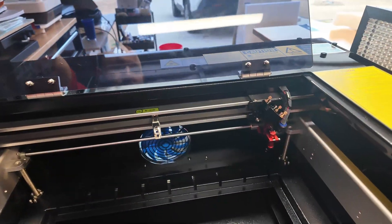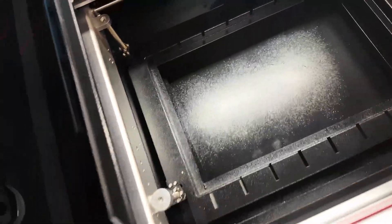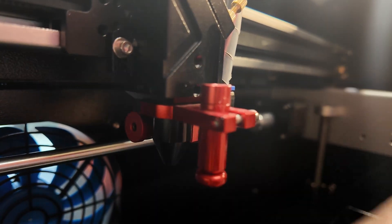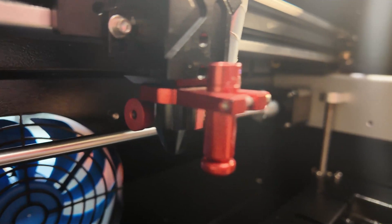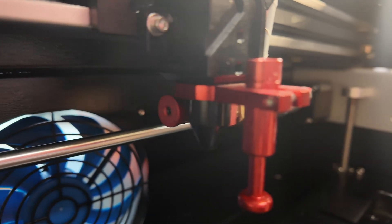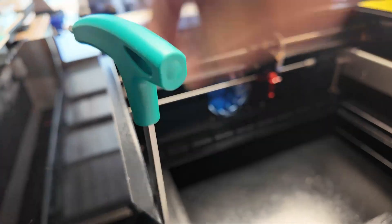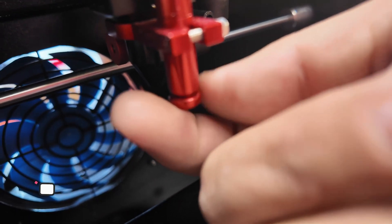Here's the little door — it's a small working area, as you'd expect from a compact CO2 machine. This is the semi-auto focus, and it's actually quite simple. It's a magnet with another magnetic part. When this is down, you move the lever to raise or lower the bed. Once the material touches it, it retracts.